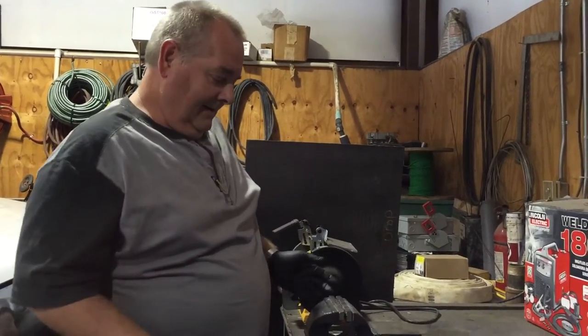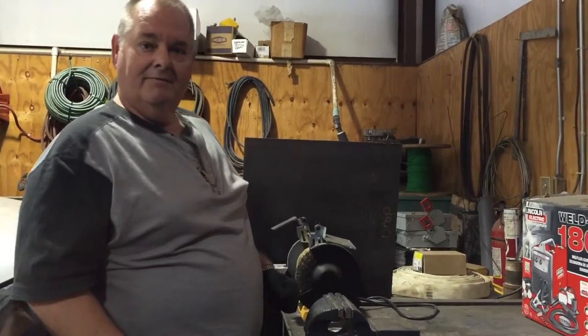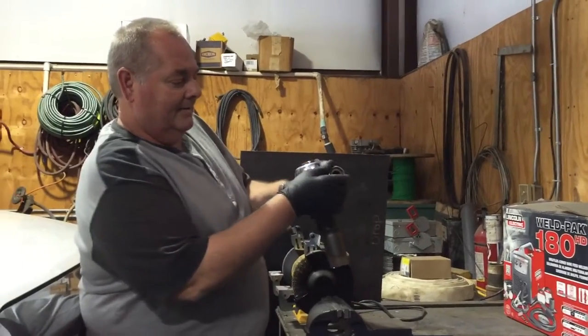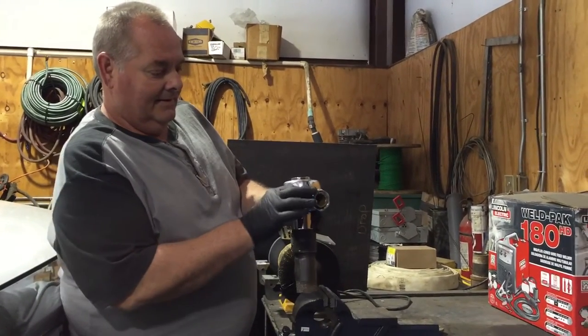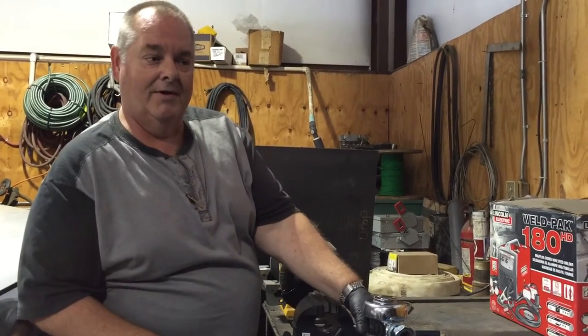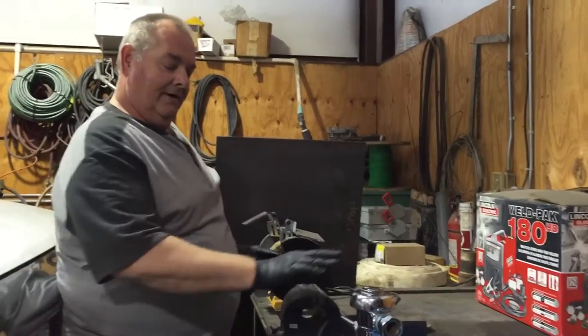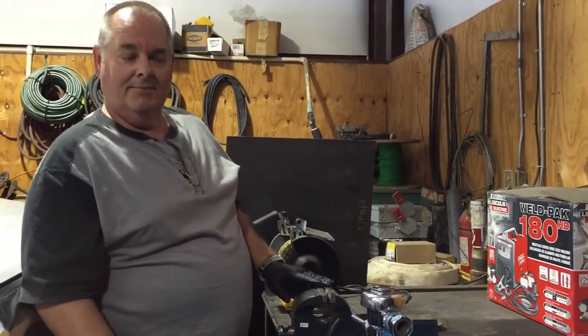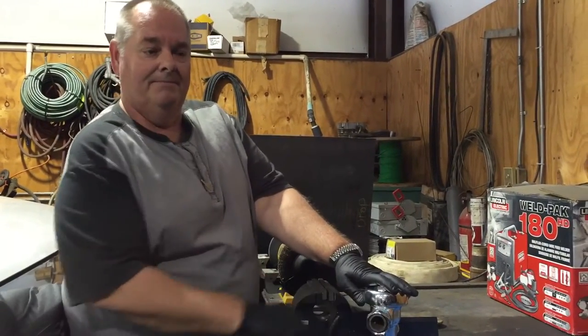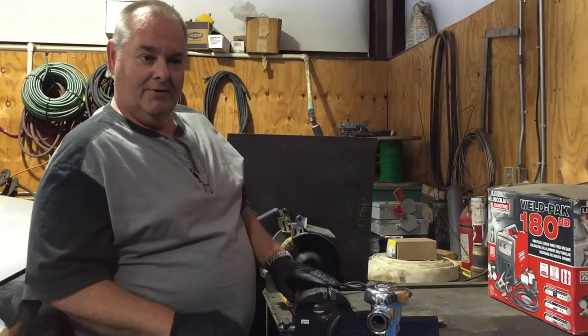So let's start by saying, say you've got a flush valve you rough in on a wall. All nipples come standard — I'm talking about this shoulder nipple right here. They're all the same height when they come out of a box. If you miss a rough-in in a wall, then the problem we've had — being 28 years in the plumbing business — is it's a booger bear to get this nipple out of this valve without damaging the chrome.